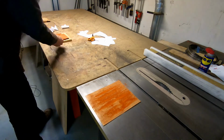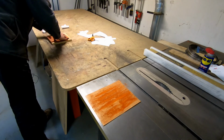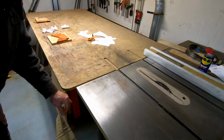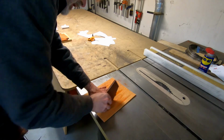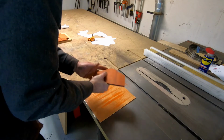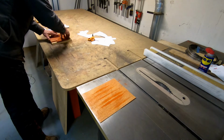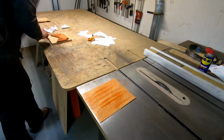And of course, those of you who have never done inlaying, there is a trick, and everybody cheats: when you glue up your inlay and you've got some glue in whatever imperfect cracks there may be, and then you sand the top, the sawdust fills it in. It's an old luthier's trick from a long time ago. Of course, I just want it to be perfect, so I try my best.